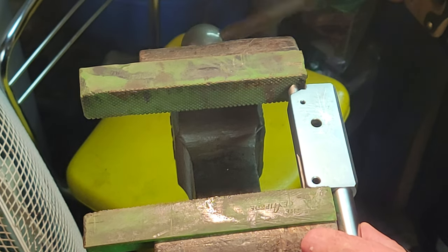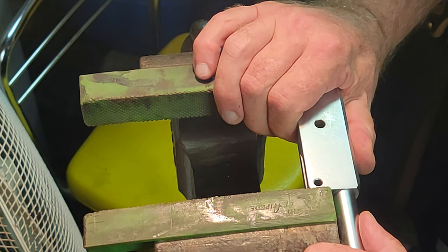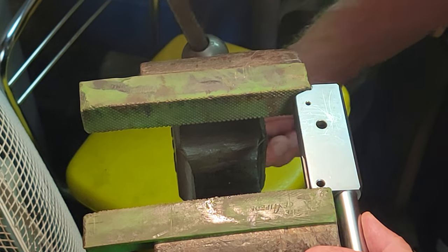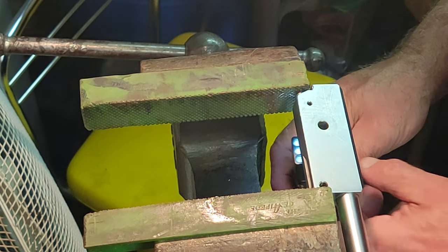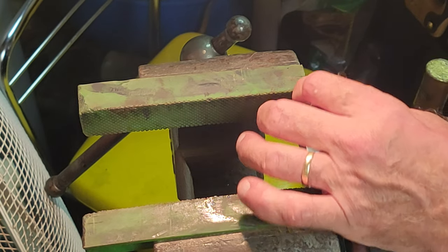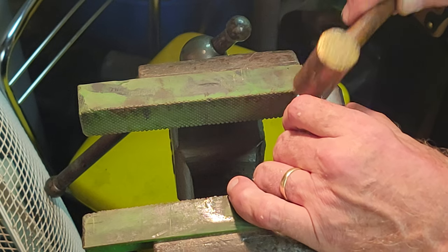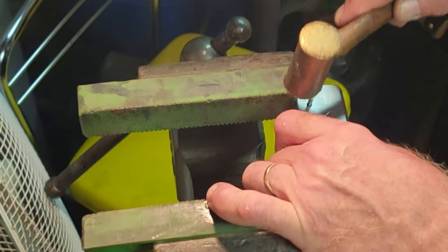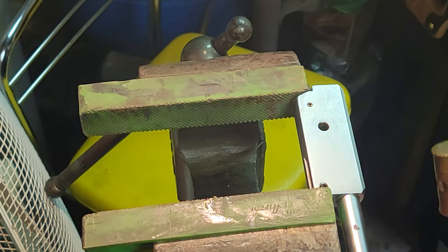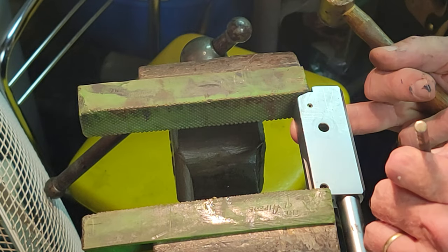A little pressure with the mainspring, with the bench vise, until we get that recess lined up with the hole. Check it by looking through with a flashlight, make sure that we can see the light on both sides there, and then we know that we've got a nice clear passage to replace that pin. Couple of taps to make sure it's centered within that breech block.